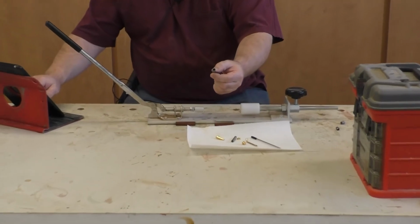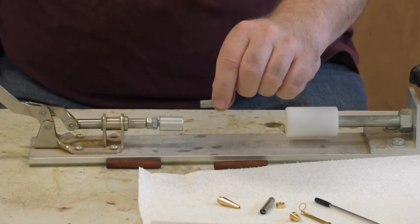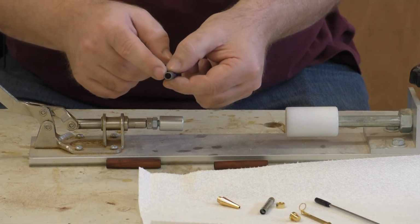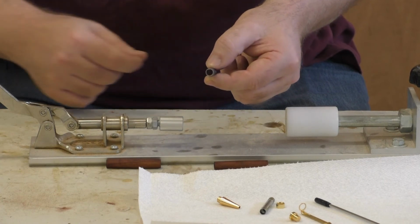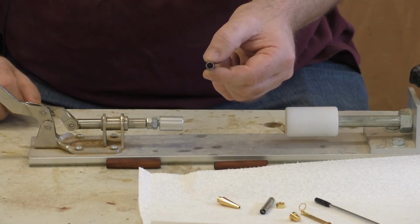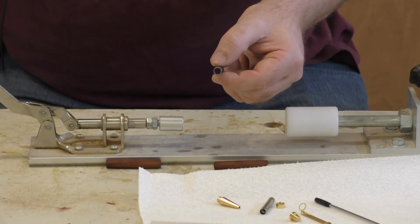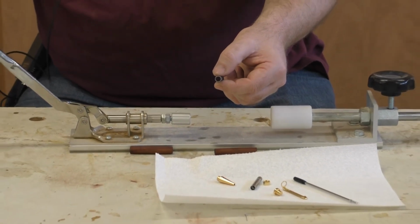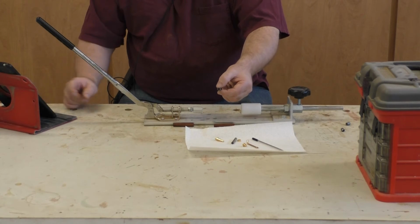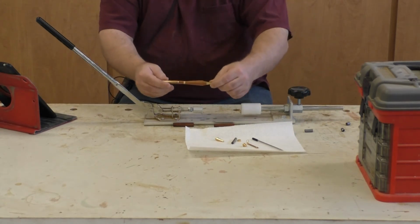Let me just zoom in on them so you can see what the bushing looks like. And if you turn to the thickness, this outer diameter of the bushing on both ends, all the way around, you end up with basically two equal, in every respect, parts. So either way can go up or down. Now where that changes is if you decide to add a profile or make one side slightly bigger for your hand and such. A good example would be this pen here.